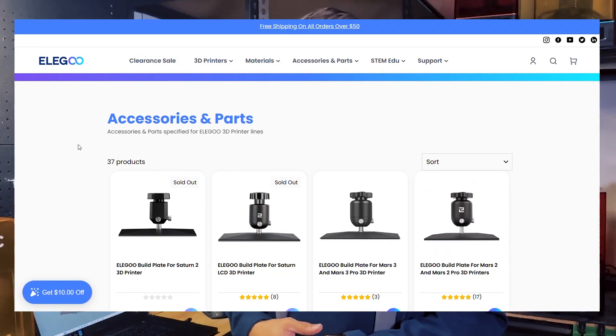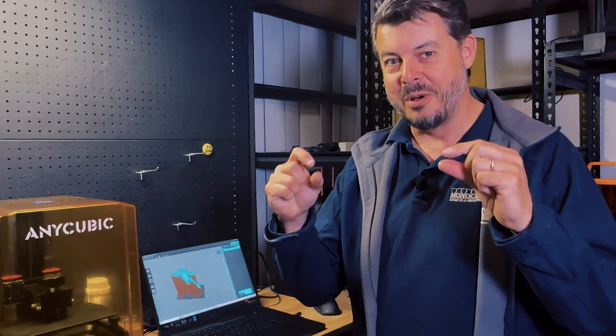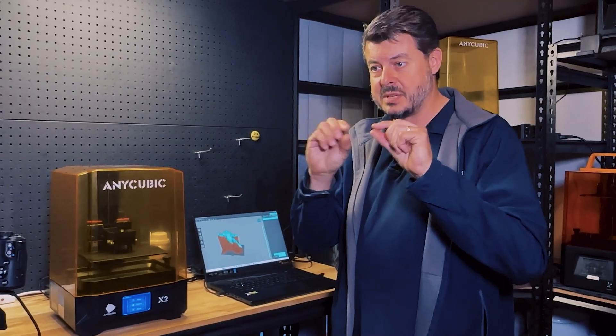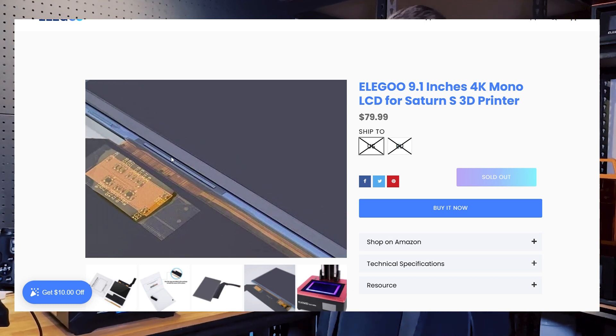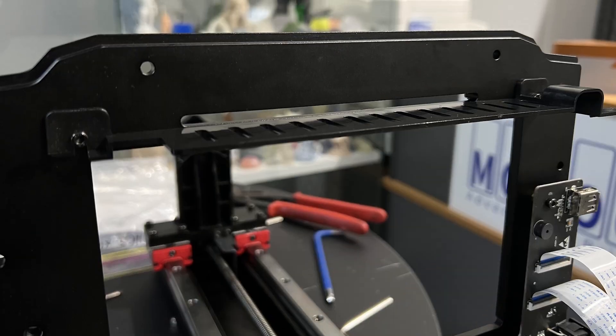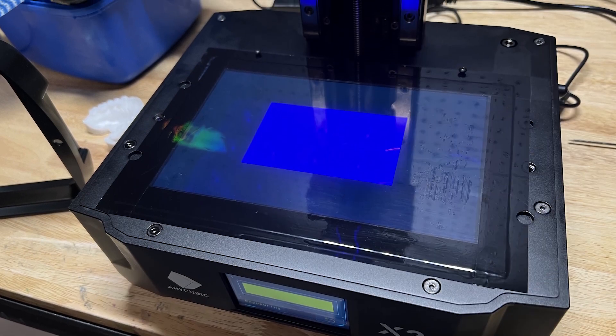It's such a new printer that we couldn't find one specifically for the X2. What we did find is that the Elegoo Saturn S has exactly the same LCD screen. Unfortunately, when it arrived, we discovered it had a thick piece of glass glued to the LCD screen. The existing screen is not glued to any glass — it sits above a very thin piece of glass, about 2 or 3 mm thick. The new Saturn S screen had glass about 4 mm thick, so it would have sat too high in the bevel. So I went extreme: I took the whole printer apart, pulled the top metal off, took it home, put it in my CNC router, and made that recess deeper — just the right depth to fit the Saturn S LCD screen assembly straight in, put it all back together, put the tape around it — good as new. So I've been able to print since we had that mishap.